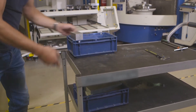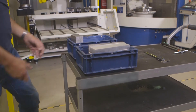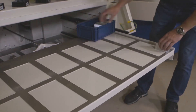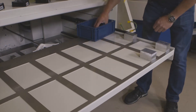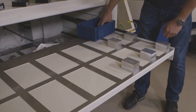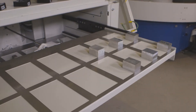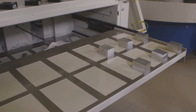In this specific case we also configure the upper station and lower station, because for example the second height is lower compared to the raw material, which you can define of course. It's as simple as that — you just put the pieces where you told the control they will be. Programming the cellular automation is like you are used to from your CNC machine; you don't program the robot, it's all tool center point related.